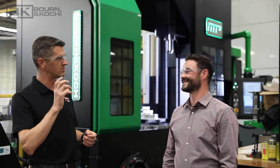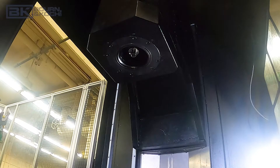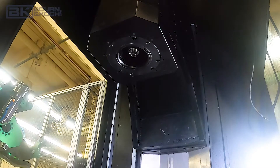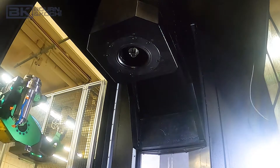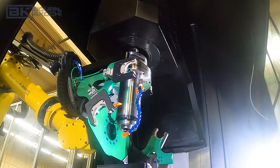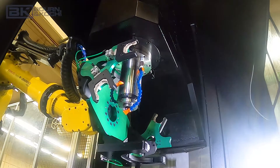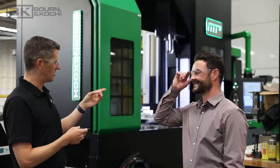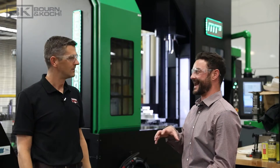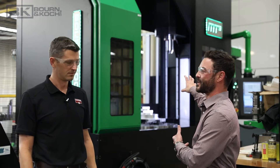Tell me about the spindle again. So it's swapped out — not just the holder, but the whole spindle? It'll swap out the entire spindle and the tool itself. So let's say you had a grinding spindle in there and you wanted to do an ID grind with a larger wheel, then you want to do an OD grind to a shoulder — you could swap out those individual wheels to hit all of those different surfaces with the right wheel. So the motor stays upstream, but you're actually swapping out the whole spindle cartridge assembly. Yes. Because I saw HSK 63 and a different HSK taper — so it's not just the HSK spindle, it's the part that holds that. It is. We call it our HBK 200 connection — it's a very large HSK taper that fits up into that portion of the machine.